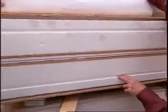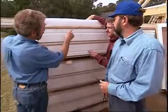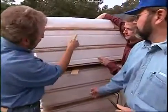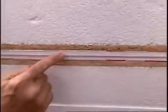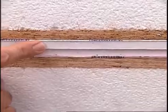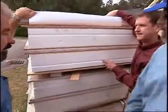You're looking at about R34 here in this particular roof panel, but that's a continuous blanket of insulation you're looking at here. No interruptions. And so we've got the oriented strand board, and then in addition we spec'd sheetrock for our ceilings, and that's already in place as well. That's what you're looking at here. Right, that's pre-applied right to the panel, so as soon as it's set, your drywall's in place. Excellent. And then it's backed up with OSB also for nail base.